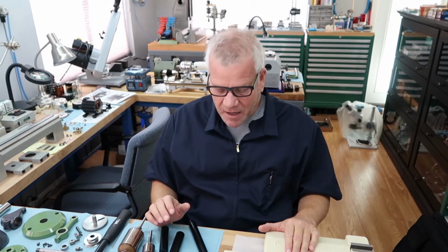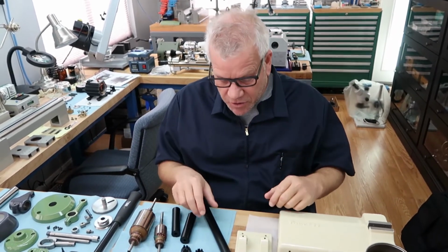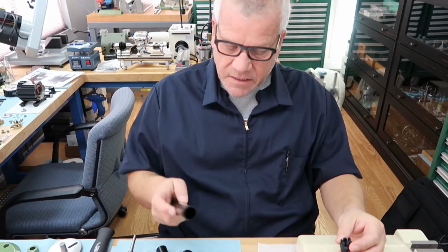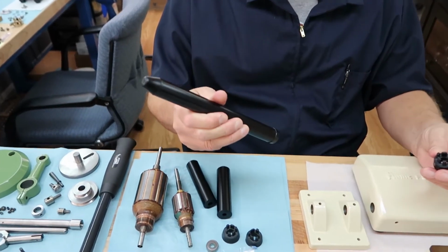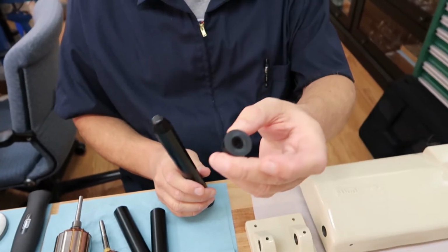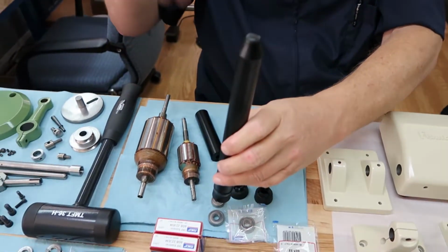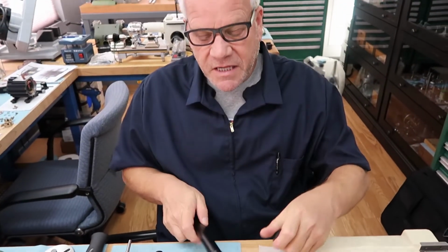Okay, hey, welcome back. I'm back in from the machine shop now. Let me just reiterate what we went out to the machine shop to do. SKF makes a bearing installation kit, and this is the post, which you can hammer on and you can use in the press, and they guarantee that, as you can see there. And this is a die that goes on it, and they make them all. This is the 10 millimeter die, by the way. You basically put it on there and put it in your press, your hammer, whatever you're going to do. Remember, we couldn't go below 10 millimeter because SKF doesn't make it.